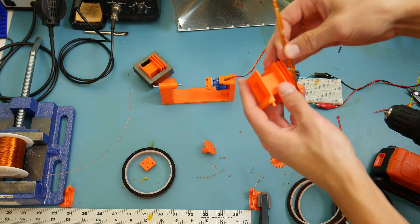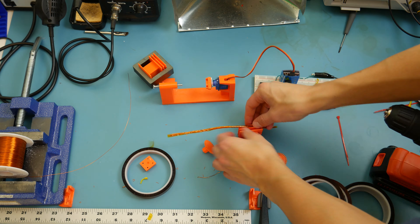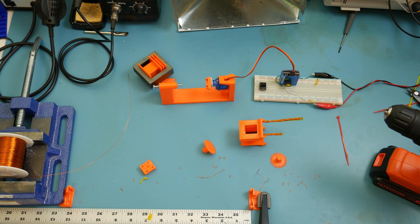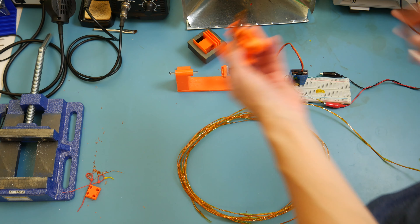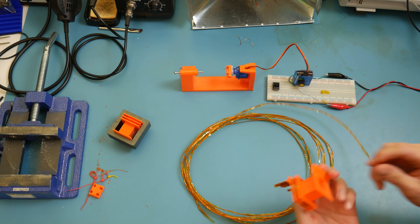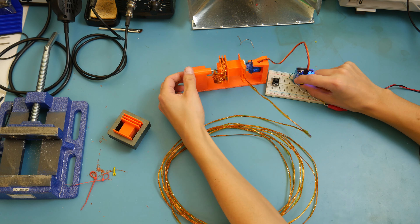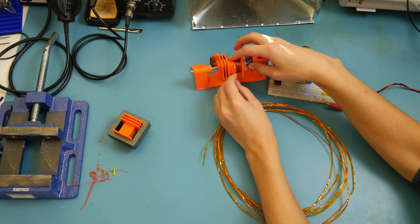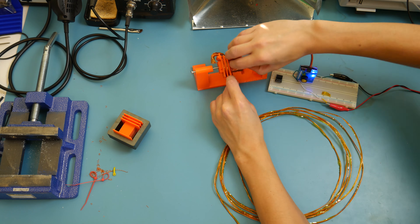This is the first one we built, so there were little issues like that, but all in all I think the winding turned out pretty good. The two primary windings are wound now — we're just making them as square as possible and compressing them down. This is where the second jig comes into play: we'll use it to spin the transformer to get the secondary wound, and there are a lot of windings required here — 32 windings.